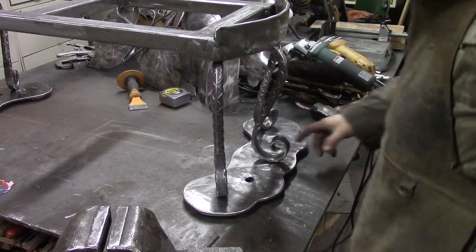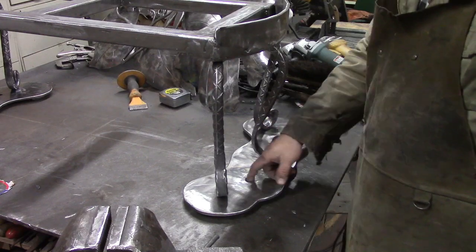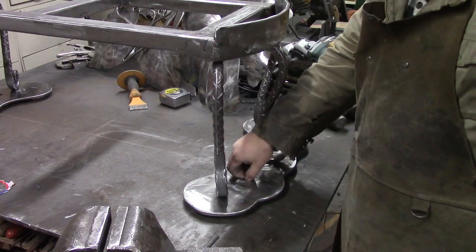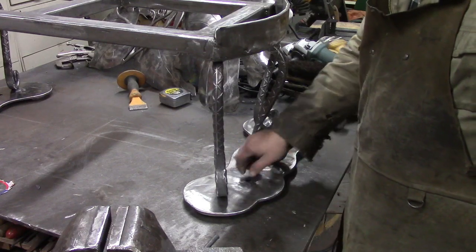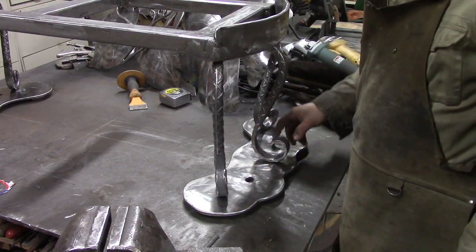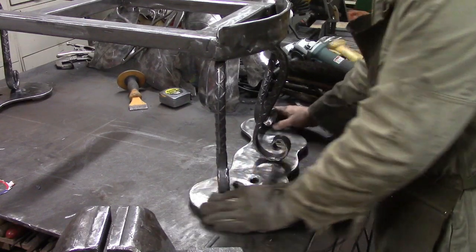We've designed this so that our holes that hold our sculpture to the concrete pad are in between the legs and got plenty of room to drill us a hole. And the holes are a little bit rough shaped, but they're plenty big enough to put a 1/2-inch bolt in, is what we're doing. This one has a little bit of a point on it. I may touch that with something, but we're going to play with this and get this sitting just like we want it.